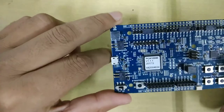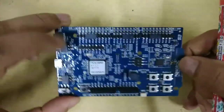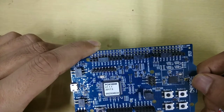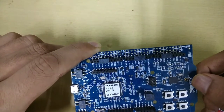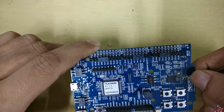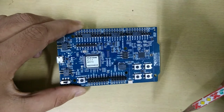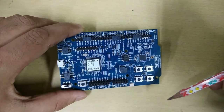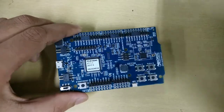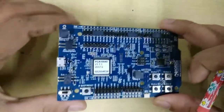If you want to develop your IoT applications, definitely you can develop your IoT application on this board. It is powered with the ARM Cortex M4 microcontroller which is running at 64 MHz. The ARM has many peripherals such as SPI, UART, and I2C, and it also has DMA on chip itself. Let me tell you more about this board and the other supported peripherals.